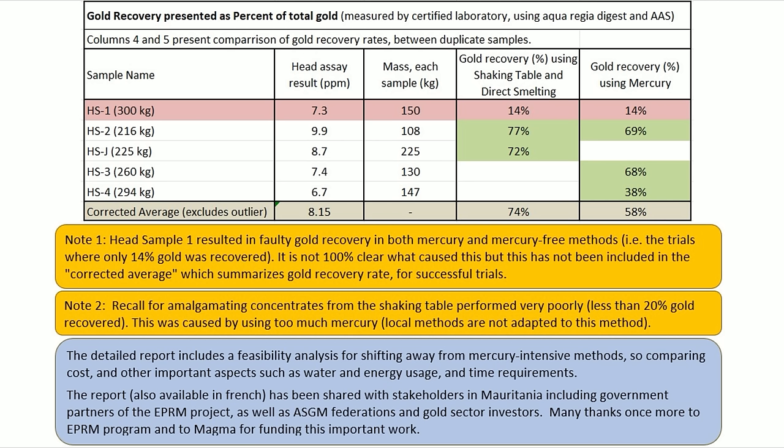And here are the results for our test, and you can find the full report in the description below. I have a link to it down there. But I was really happy with the results. The gray brown bar at the bottom shows that the gold recovery using just the shaker table and direct smelting was about 74%, versus the gold recovery using mercury was about 58%. And we recovered about 15% more gold using just gravity and smelting versus the local mercury methods.